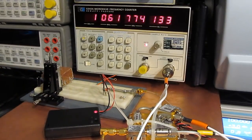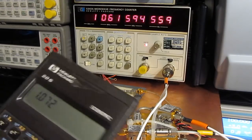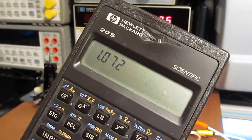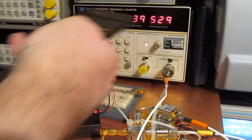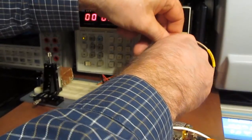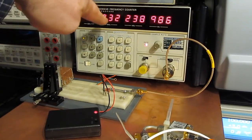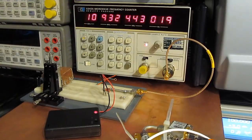So again, it was running at 10.928 originally. So if we take 12.0 minus 10.928, you can see that's 1.072 gigahertz. It's possible we may have bumped something. Let's just see. Oh, sure enough. See how it's changed that little bit? 10.932